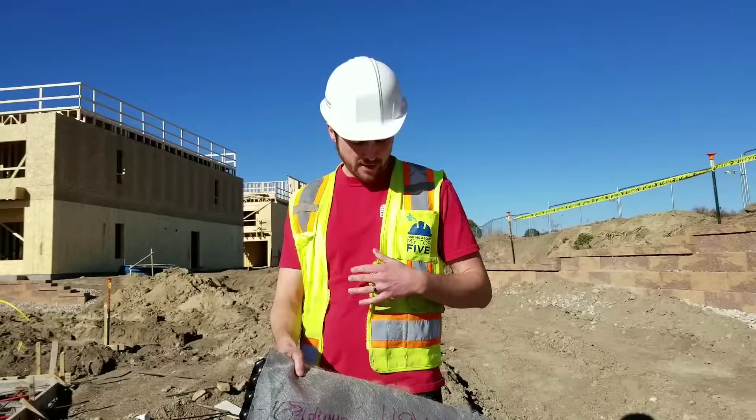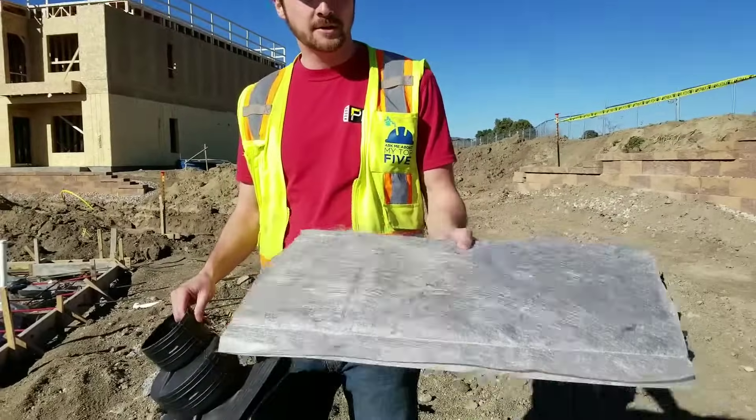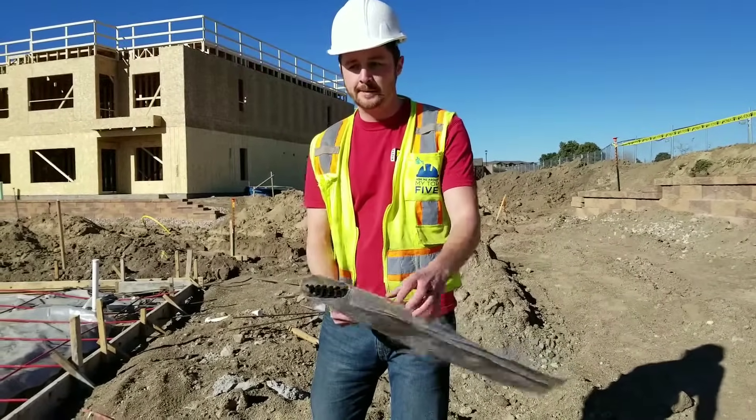This is Brent with Professional Discounts Supply. We're here to go over the installation of soil gas mat on an actual job site. Here's the mat material — it comes in 45-foot rolls, low-profile mat, 1 inch thick by 12 inches wide.